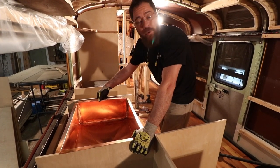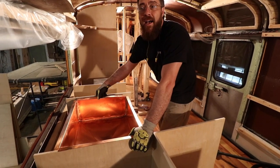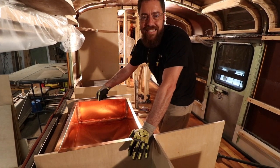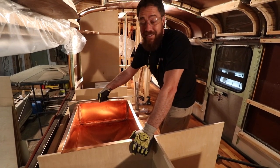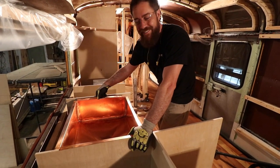So we need to get stuff that's maybe 2 to 3 years old that's already been cut, just sitting there for a couple years, because the moisture content needs to be a little bit lower. Like we're looking at 6 to 9% probably. So we might get one of our buddies who has a moisture meter to come with us and go shopping for some countertops at some point.